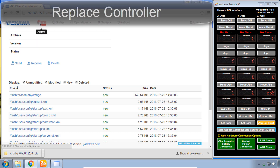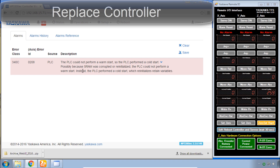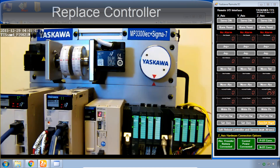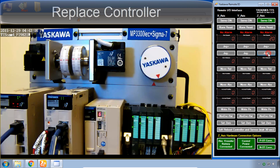Looking at alarms, it says the PLC had to perform a cold start because the retained variables were cleared out. We talk more about warm start and cold start in the IEC Basics video series. This is why we see that zero-set is required again — whatever variable remembered whether the zero point had been set for this encoder has been reset, and the position is now invalid. We'll acknowledge zero-set-required and turn the servos back on. Set your speeds again — try 20 — and jog positive, jog negative, or move to absolute zero.